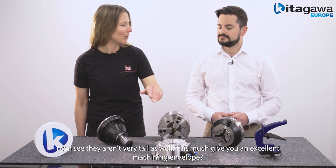Do you want to see some more work holding? Of course. So here we have on display the DHP-52, a pullback quick change collet chuck for bar-shaped workpieces. I'm very familiar with the collet chuck. It's very easy to change the collet sizes. And you can also use different shaped bar. Collets are available in round, square and hex profiles with a gripping range of three millimetres up to 80 millimetres.